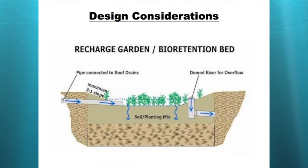Here's a schematic of a standard rain garden showing the riser and barrel outlet. It also shows a pipe coming in from house downspouts — if you can pipe it into the bottom of your rain garden, that's best. Overland flow often results in erosion and mud coming in, which you don't want. The schematic shows the soil planting mix and the existing native soils underneath, which you can scarify. The domed riser is incredibly important to prevent clogging.